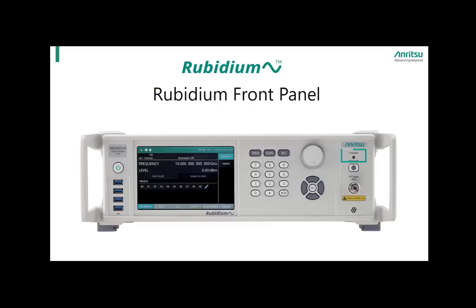On the farthest right, Rubidium features a red LED unleveled indicator. This LED is activated when the RF output goes unleveled, normally caused by exceeding the specified leveled power rating. This is an important feature for manufacturers with rack setups who want to visually see if there is an unleveling issue that may not be easily visible from a test graphical user interface. Below the red LED is the output power on and off button, and directly below that is the output connector and caution label. The standard output connector is a male RF output connector.